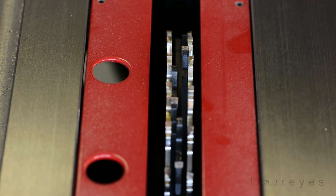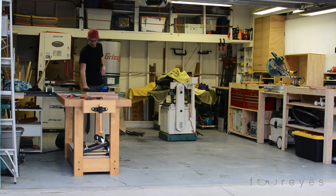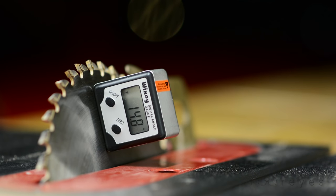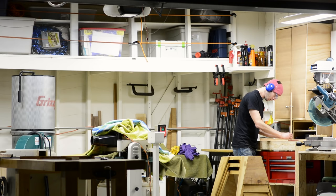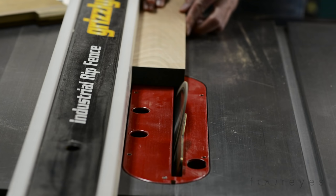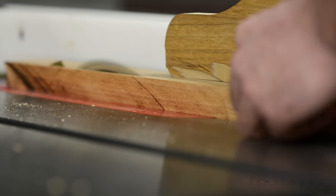Cutting the cross connector pieces was the first part of the bench that was a little tricky. The reason for this is the taper of the legs — the outside edge of the cross pieces would be at 15 degrees to match up with the legs, but the inside of the legs are basically just some random unknown angle. I did my best to measure and I came up with 18 degrees. Also, each cross piece is a different width; they need to get wider as you get closer to the top of the leg. So I marked out everything, set the blade, and cut a 15 degree angle off one side and an 18 degree angle off the other side.